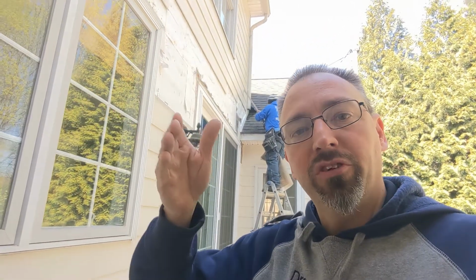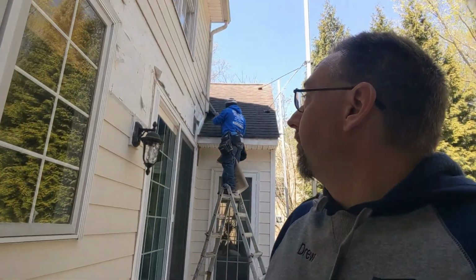And once we get these pieces of aluminum in where they go, that allows us to bring whatever the house wrap or the HydroGap that we're going to bring down over the other side, keep moving those layers out so that things are constantly being moved out. Once all those pieces are in, everything's flashed correctly, we've got those water control layers in where they need to be, and then we can continue with installing the rest of the James Hardie board.